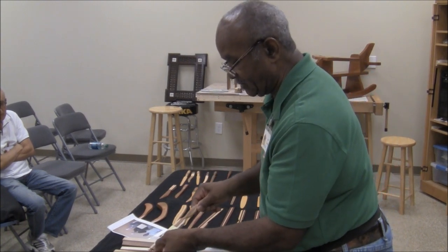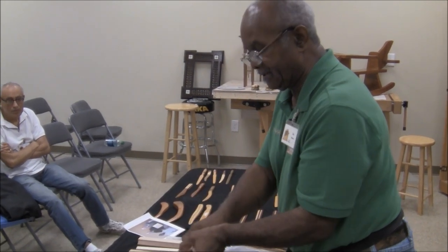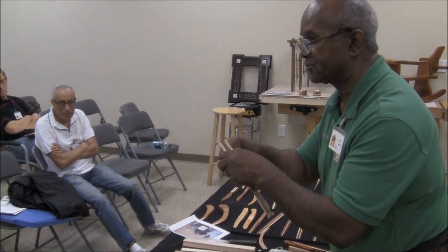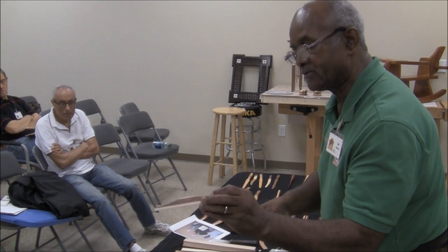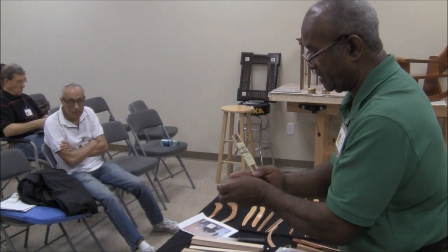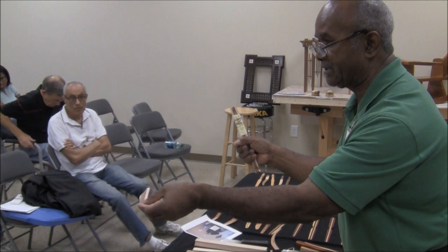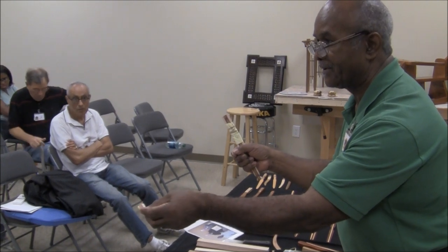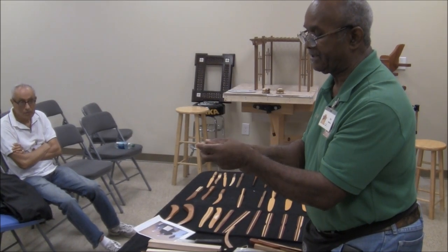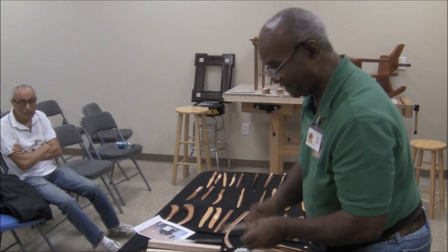But the thing is that yellow wood is a dyed wood. It's all right in the handle here. It's all right here in the blade. But when I shape that blade to be thin, that yellow wood is going to split right down the middle. And that's where I got this piece to show you. This is that same wood. The fibers stuck to both pieces, so the fibers themselves split. The joint didn't come loose. The yellow fibers were on both pieces of wood that came off. So that's why I didn't finish shaping this handle. I realized I made a mistake. That was a lot of pretty work, but that was the other thing.